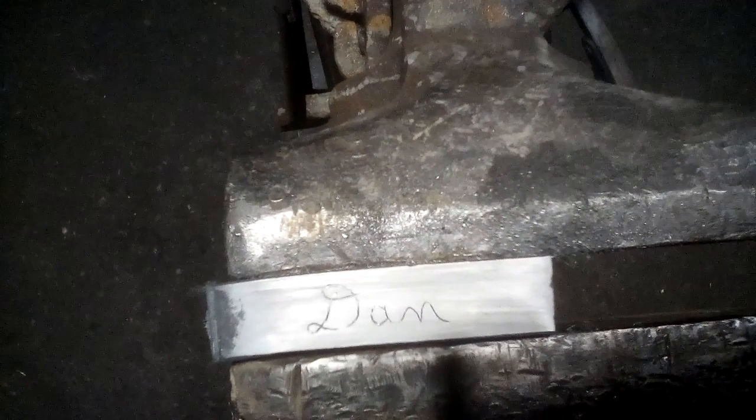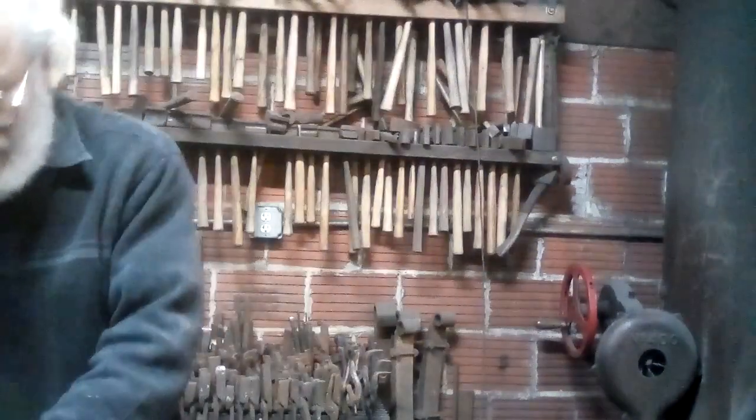And in the old days, they didn't have sandpaper as such. They would take a stone, and a lot of the polishing and background finishing would just be a stone finish. You see, this is a water stone that makes a nice paste. And it's the paste as much as the stone itself that cuts. So this is our 5-minute engraving class.